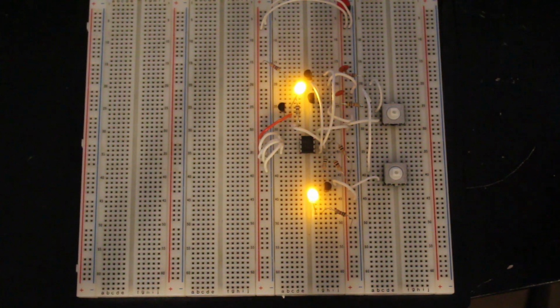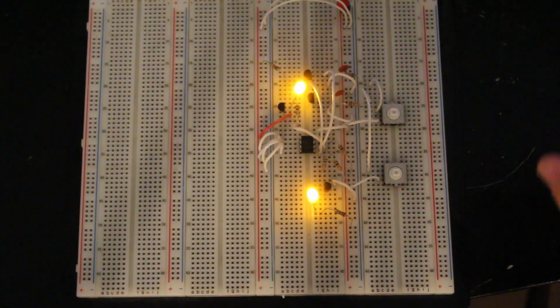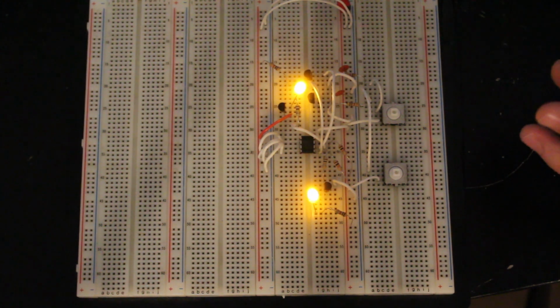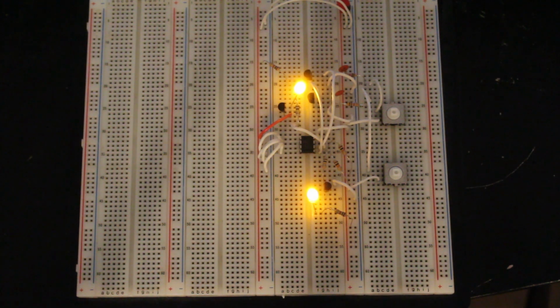So it's a bus. So you can connect all these devices to those same two wires where the microcontroller is the master and all of the devices are the slave, so that the master actually controls when it wants its data and when it's going to write data to the slave devices. It's only two wires, and in fact it's a lot of times called a TWI interface, or two-wire interface, and they market it as a really simple, easy to use two-wire interface.